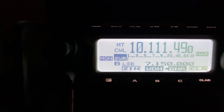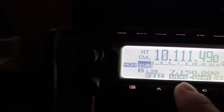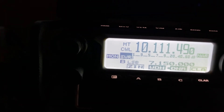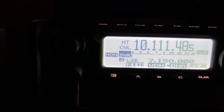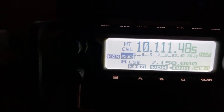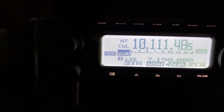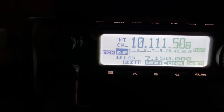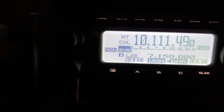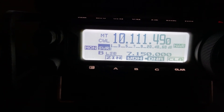Still just a little bit off using the spot there. If you assign the zero-in to one of your A, B, C quick keys, you can long press it and it'll light like a spot. But if you've got the zero-in LED enabled in the menu — I think it's menu 2-06 — you can just look for that blue light to come on when they're sending. Just wanted you to see this opportunity with the FT-891 showing off the filtering capabilities.